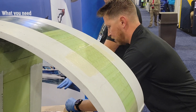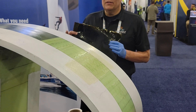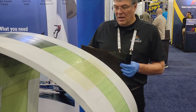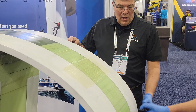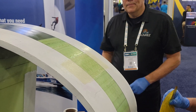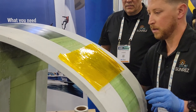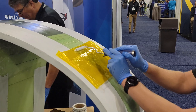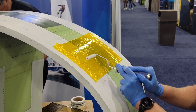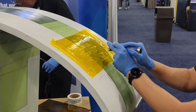These prepregs are guaranteed for 12 months at room temperature storage — no refrigeration, nothing needed — and as long as you keep it from UV you basically have an infinite working time until you turn on the light. So we can go ahead and throw on our second layer here and we'll do the same kind of motion, working from the middle out, which will allow you to create a really nice seamless resin section between the two layers so there's not going to be any air voids going that direction.